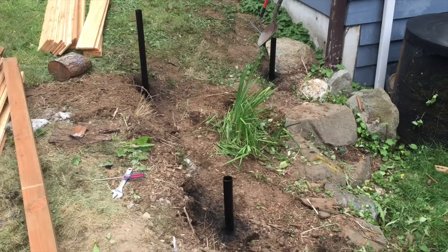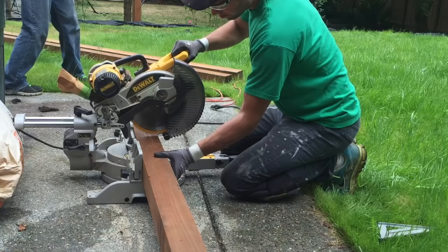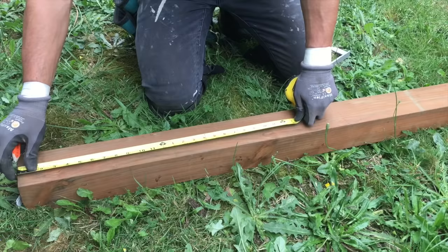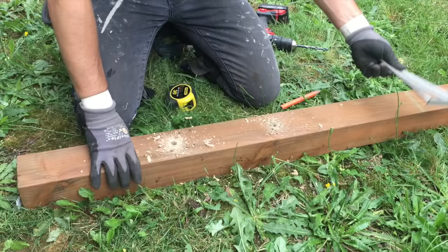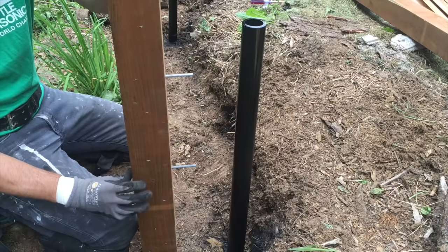I don't need a super tall fence line, which is why I bought 10-foot posts and I'll be cutting them in half — this way you can save a little money. I measure the bolt hole locations on the steel pipe and then transfer that to the wood post, trying to be as accurate as possible. I suggest using a fatter bit than you actually need because that gives you a little leeway when maneuvering the posts once they're in. Go ahead and insert your bolts to see if your measurements turned out.